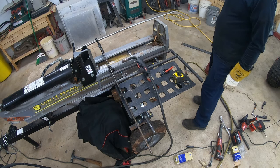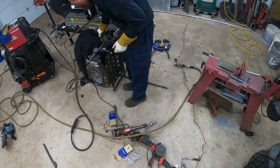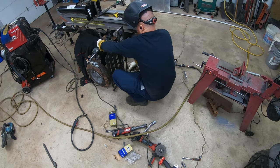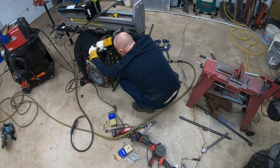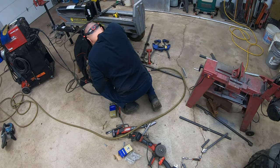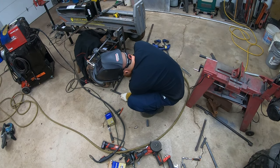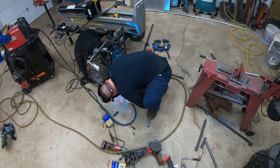This is the start of the foot part of it. With more forethought I would have made that piece go all the way across, but like I said I just kind of started winging it - cutting stuff and welding it in. This piece will go from the axle down to the back side of the foot just to brace that up, and I put two pieces in - one off that far piece that comes out, and one in the middle to strengthen it.